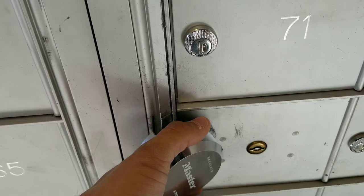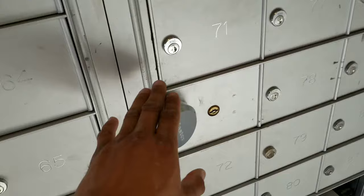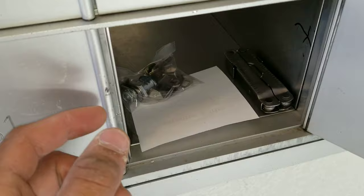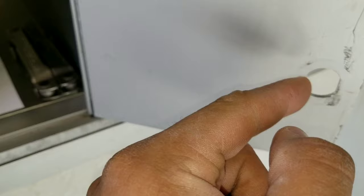Once they open this lock, every single door will open as one complete door. I have seen guys when they lose the key — what they'll do is stick a screwdriver in between the door and wedge it open. Then they'll take a hammer with the claw side and literally just wedge it and pop it. Just make sure if you go that route that you do it on the lock portion itself — you don't want to bend the doors. You can see here there's been some scratching and a few nicks from somebody prior trying to open it up.